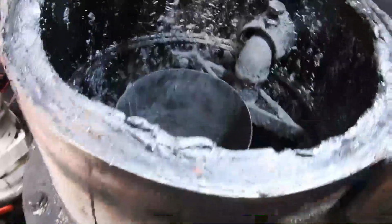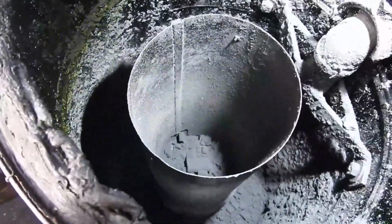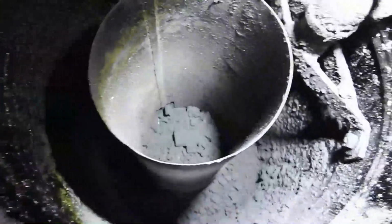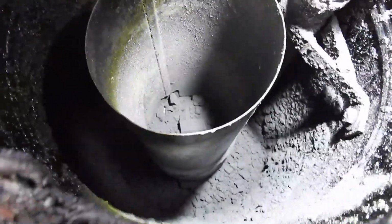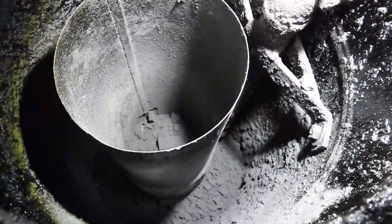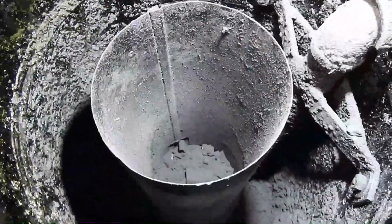Just point the camera better. Right, so that stainless steel tube there is the Torrefaction fuel column. I accidentally spilled a bit of charcoal down it while trying to fill the area around its perimeter. What I'm trying to do with that charcoal around it is to seal it so the only gas flow into the hopper is through this nozzle system that the Torrefaction pipe sits on.